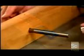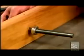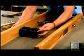On one of the frame pieces, they mount a metal plate bearing the loom's model and serial numbers. They assemble the pulley system on which the harness cables run. They thread the plastic pulleys onto a steel axle and position the axle with steel discs called stop collars.